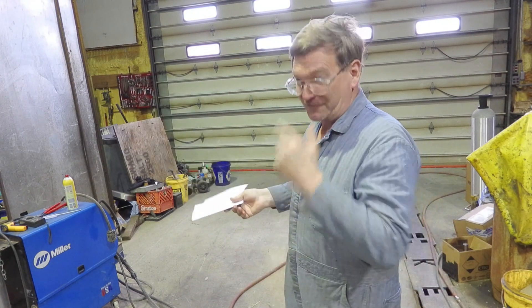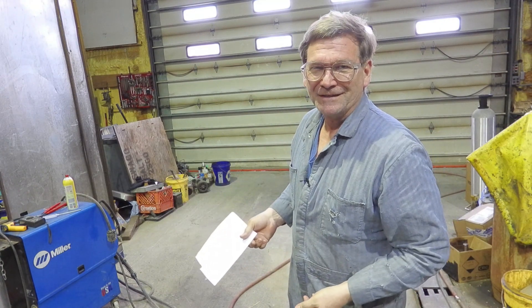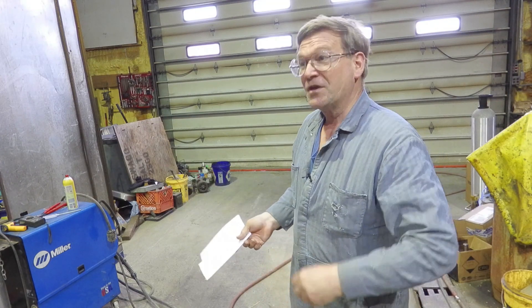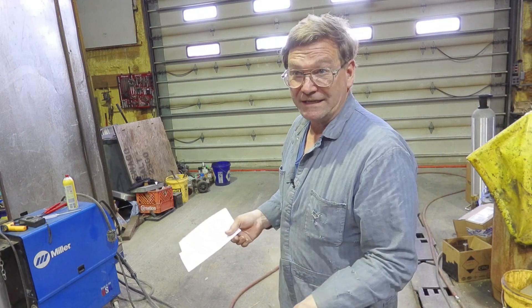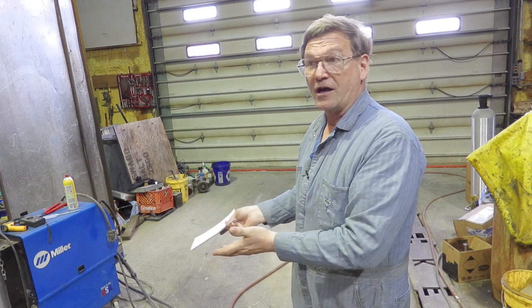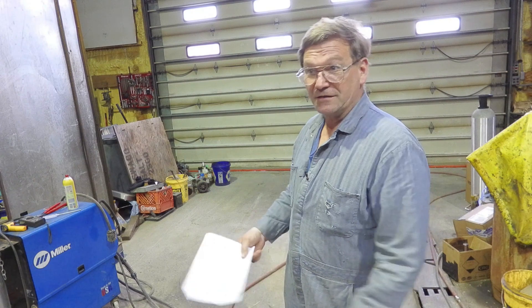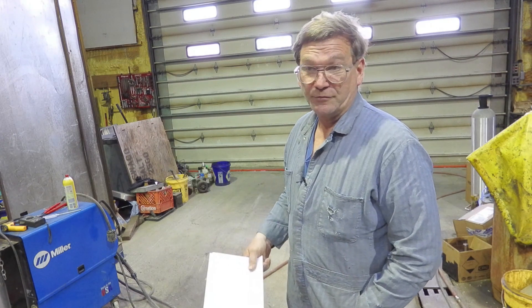A lot of people say they cut thick stuff all the time, but the trade-off really comes at around 2-inch thickness. A lot of people think they cut thick but they're not really cutting thick. You could even save some money over 1-inch material by going to propane cost-wise. I tend to use acetylene most of the time because I want to get started with the cut quickly and it's just handier. Propane is where I go for heating.